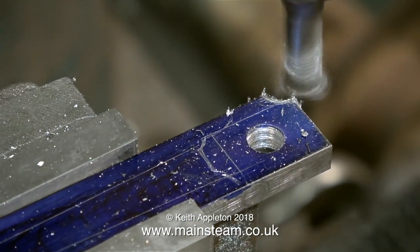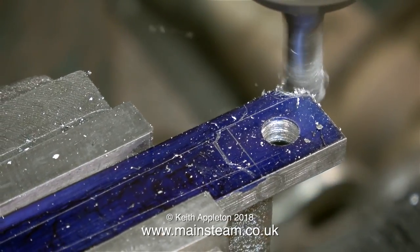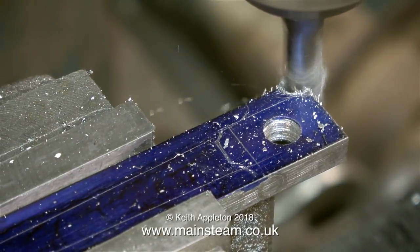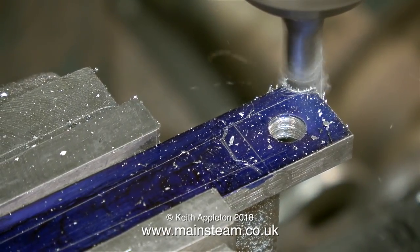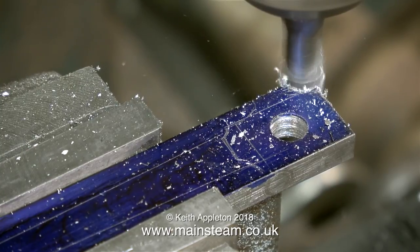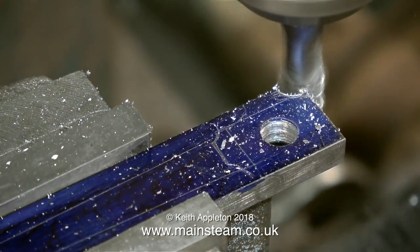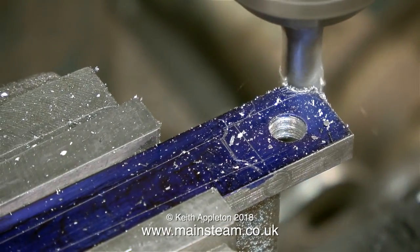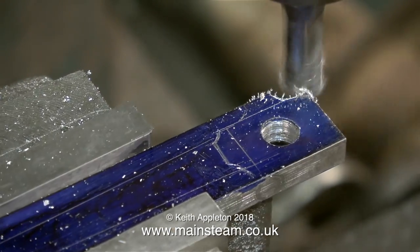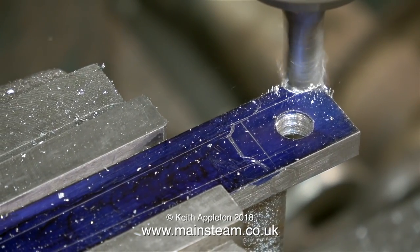Whenever I'm milling, I cannot go directly in at full depth with the milling cutter. And even on a proper milling machine like a Bridgeport or similar, the weak link is still the milling cutter because it's not very big. The solution is to set the milling cutter to take shallower cuts and many of them. It's a bit of a handle-winding marathon, but eventually you will be cutting full depth. Just be careful when you get to the end of the cut, as the milling cutter is very prone to chattering.